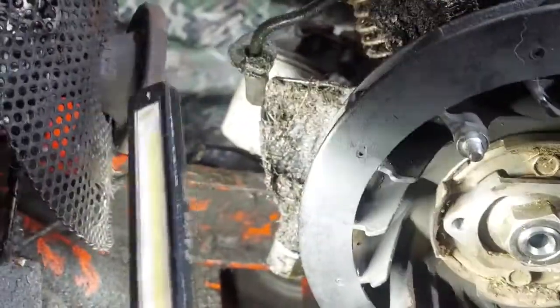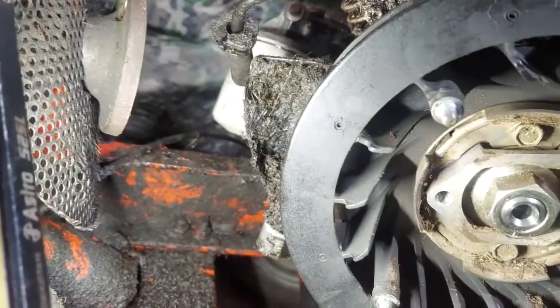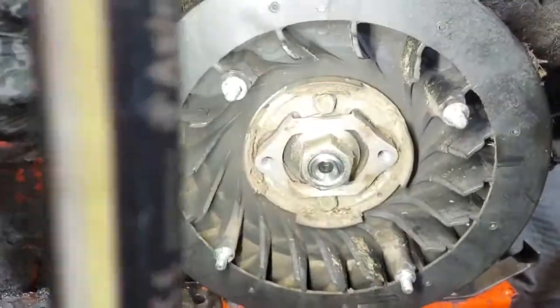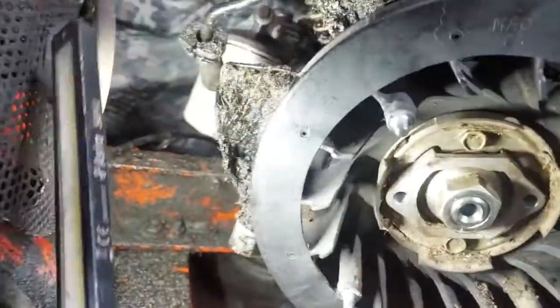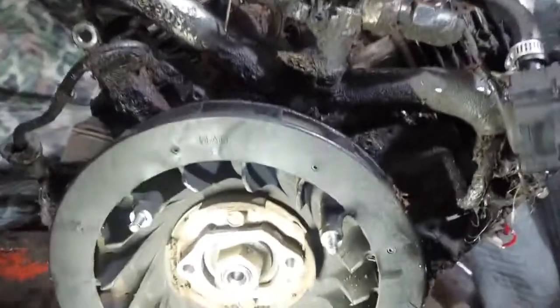If you're just doing the carb, you don't necessarily have to disconnect the pump. Sometimes you can get everything slid far enough back and the motor pulled forward with the pump, because there's some slack on those rubber lines, that you can pull the flywheel cover forward and get to the bolts and stuff. But at the end of the day, it's really not that hard just taking these two bolts and now you've got everything moved around and easier to work on.